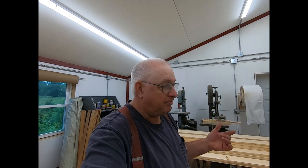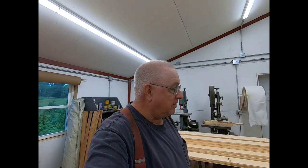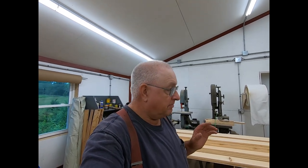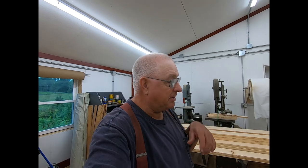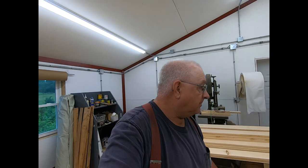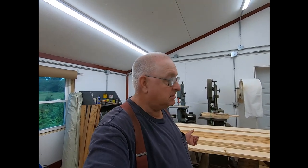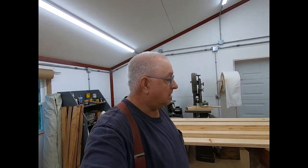Anyway, I was able to get through it after two or three tries. Sometimes it'll pinch hard enough, it'll stall. Well, it doesn't actually stall the tractor, but it'll throw the belt, and the belt's pretty tight on it. So you get into a lot of scrap there, rift sawing. But when you're doing this type of sawing, that first pass is critical, and you've got to be careful with it. So anyway, I'm going to try to see if I can salvage this as a 7/16 5-inch. We'll see what happens.